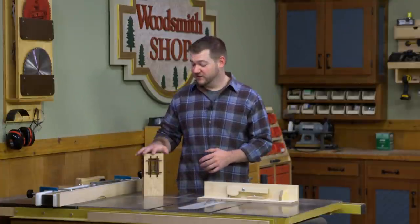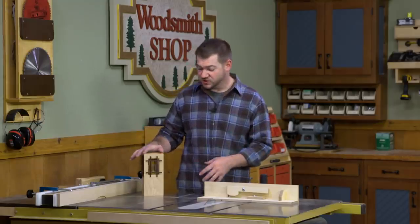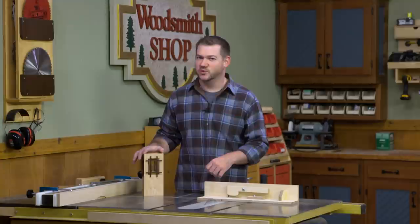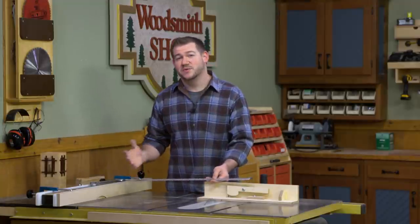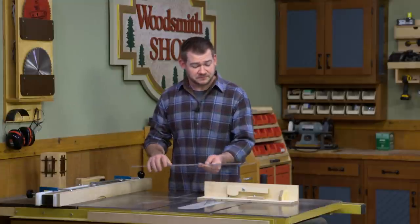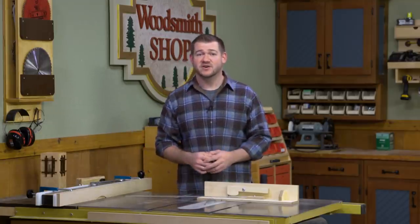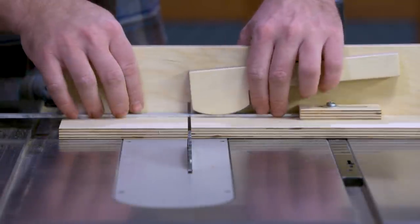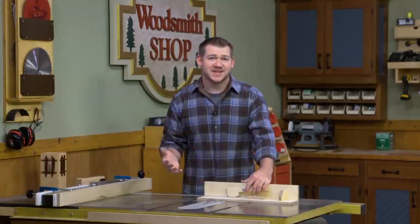One of the last things to take care of for this set of candle stands is the lattice work that covers the windows. On the original it's made from bird's eye maple with wenge lattice work, but dark wenge on top of walnut would look a little weird. So instead I'm drawing inspiration from a project from last season and using aluminum. I really like the color combination of walnut with aluminum. Cutting aluminum at the table saw is pretty easy — it just takes a non-ferrous metal cutting blade. I'll start by cutting the long uprights, then the shorter horizontal pieces, then notch the ends and add the half-lap joints.